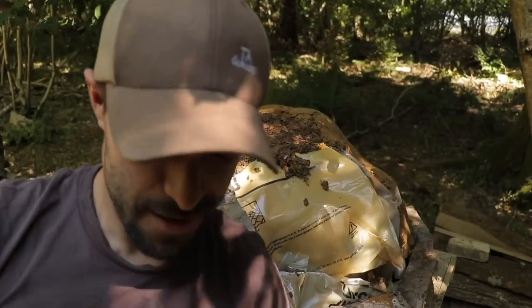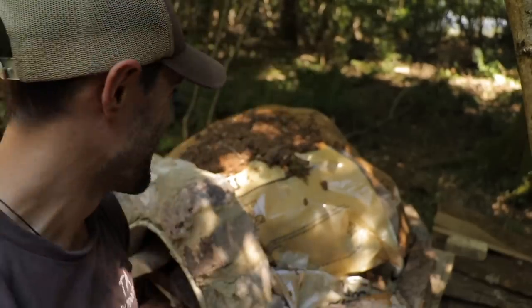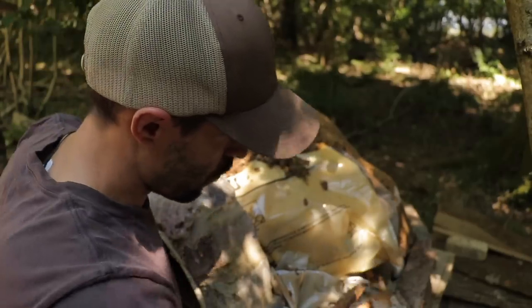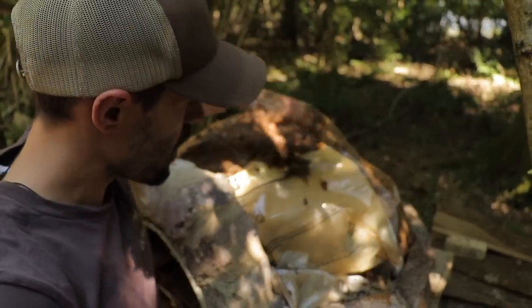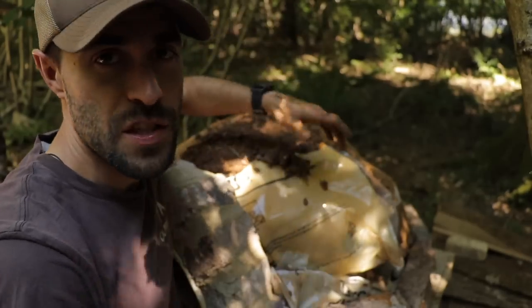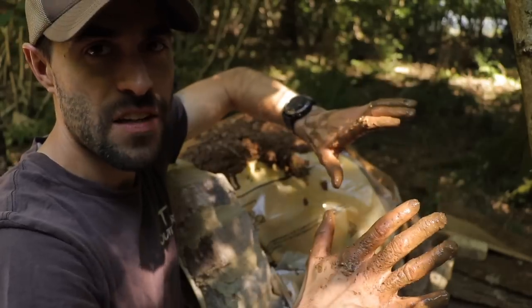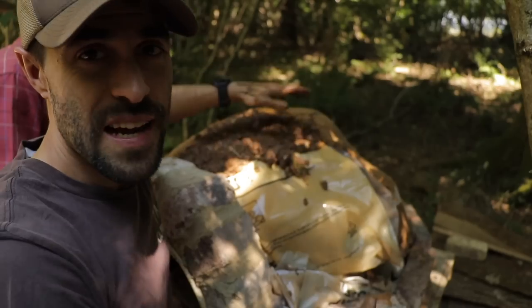Well, it's day 364 of the pizza oven build. We're basically about to start making the dome. We've done almost the first row of bricks at the base of the dome. And then normally, obviously, you could just put straight sand inside, and we're basically making it like a sand castle. You're just patting down some damp, sharp sand to create that dome shape.